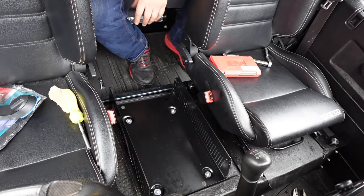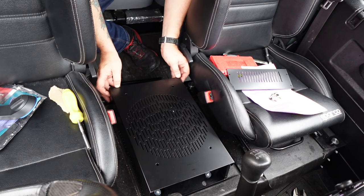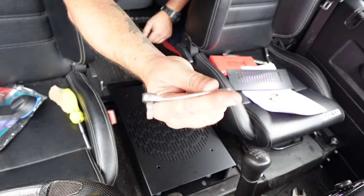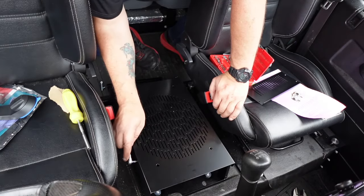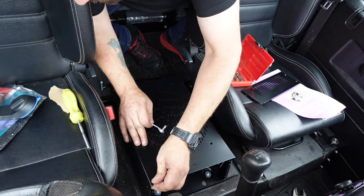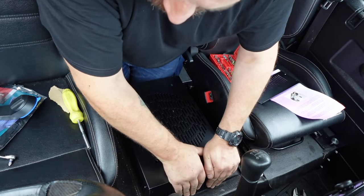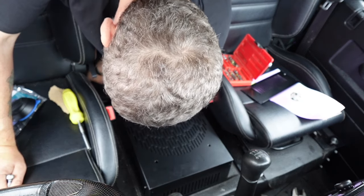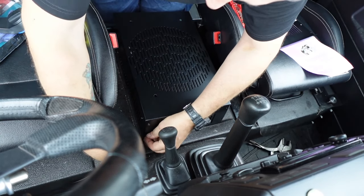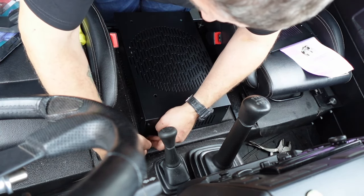We can now just go ahead and start building things up. The lid goes in position and we have to fix it in place with four screws on the sides here. This is a great little tool to use — it just means I can get access from the side quite easily and actually wind things up without too much trouble. The plate actually goes under, so it would have been better to have fitted the front plate first, but we've got it in, so no problem. We've got two fixing screws on each side and they go into the captive thread on the base plate.